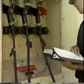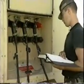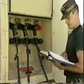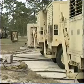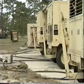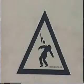The power panel box is the next pre-operational inspection point. This part of the generator set is very dangerous. The TO warns that only qualified personnel should be working on high-voltage equipment. If other generators are operating and tied into the bus, death by electrocution can occur.